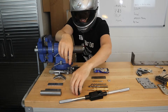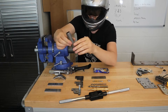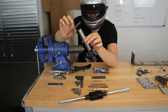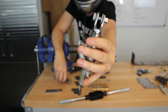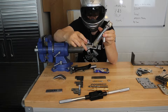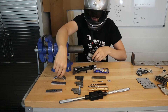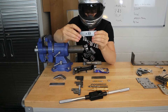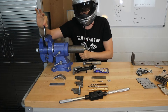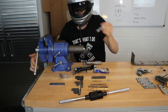Moving on to the leg: I need a round tube — just 1/8 inch, 0.125, that I'm using for the rest of the frame. I'm going to use a one inch by four inch plate in seven gauge steel, bending it up at the top into a U-shape for the leg, weld it on, line everything up for the right height, cut the bottom down, and weld the foot into place. To make the U-plate, I take the one inch by four inch metal bar, make a mark at 1.25 inches, put it in a vise, and start bending from the top — this gives you a rough U-shape.